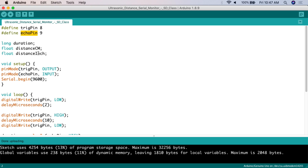Next, we need to create three variables. We're going to use a long for duration. There are different variable types when dealing with Arduinos: int is a whole number between roughly -32,000 and 32,000; float is a decimal number like 10.1 or 1000.2; and long is a whole number larger than an int — so if you need to store a whole number larger than 32,000, you use a long variable type. For duration here, we use a long.